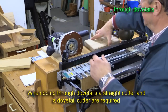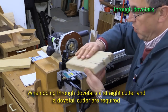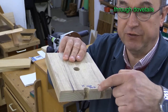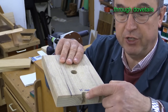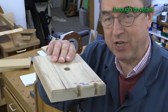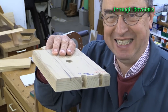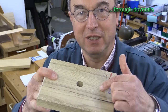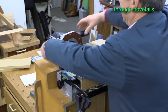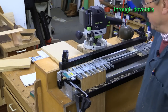In order to handle so many different cutter changes, what I've done is prepared a block of wood with a setting for both the dovetail bit and the straight bit. In fact they're actually at the same depth, so I could have used just one setting. This block also has a hole in the middle which I use to stand the router upright at the back when it's not in use.